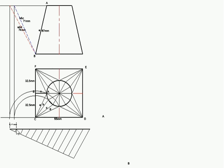So in short, the first thing that we did was to divide our circle. Then we joined those marks of our circle with our corners. Then we worked out the true lengths of each one of them, as you can see there, as well as that seam that they want us to start with. Then we worked out the true length of each one of these segments here by determining the total circumference and dividing it into 12. We are now going to do the development.